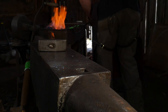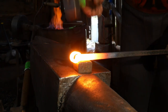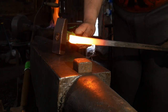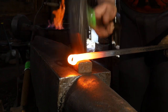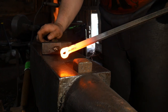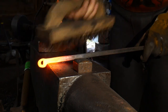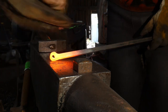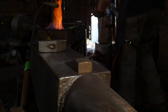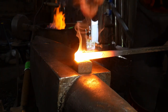In this next clip I bring it up to a light welding heat. I come out with a little radius block to weld it in. At a light welding heat it's really bright — almost white — but that lemon yellow color you're looking at is the beginning stages of the welding heat. The next heat we're going to bring it up a lot hotter, into the white zone — a white heat — and you'll see the difference as it comes out screaming hot.